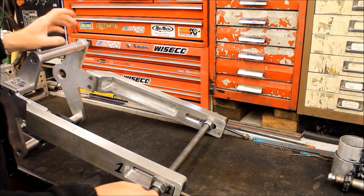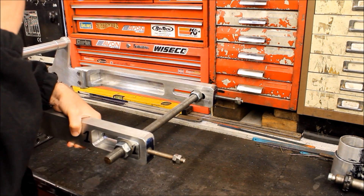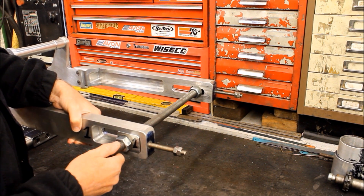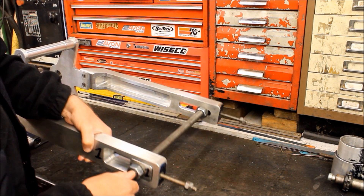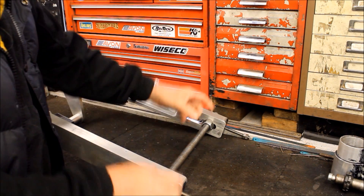It was just a bit tricky to have this on the miller to line drill it through here and through here, making sure the threads are all lined up so it doesn't bind up. There's a temporary threaded bar here just to hold it in place ready for welding.